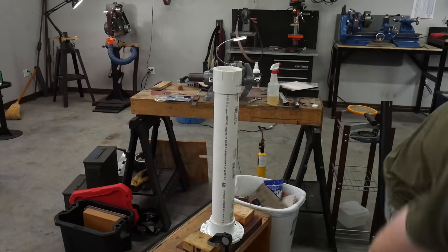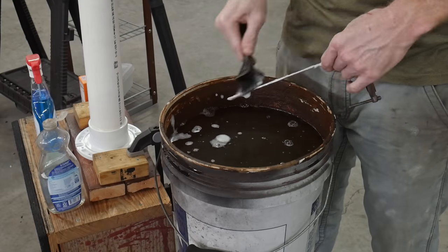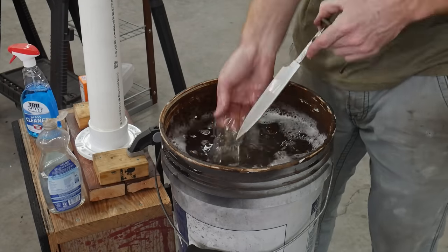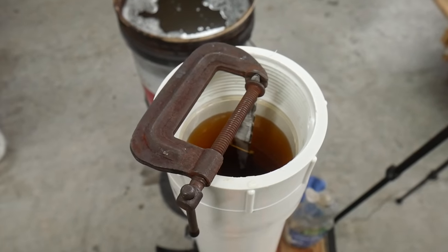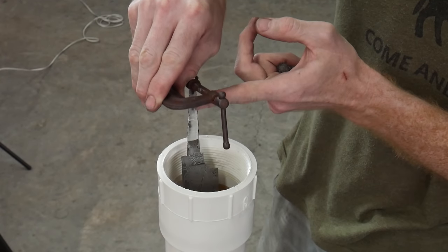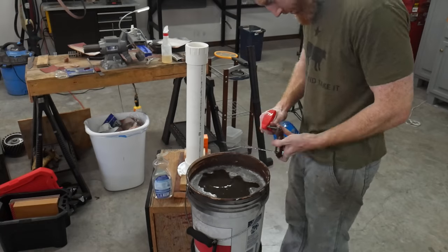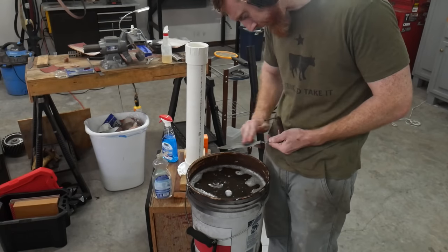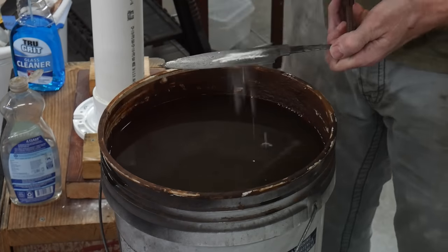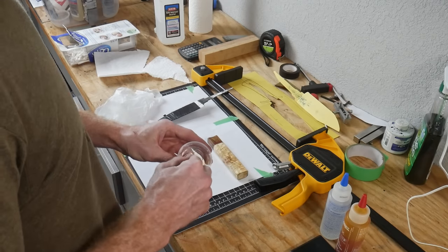I made a mix of one part ferric chloride and two parts filtered water for this tank. I was surprised at how weak the mix was — it took significantly longer to etch my blade than my previous one-to-one solution that is three years old. It could be a combination of the dilution ratio and the brand of ferric chloride. I ended up running 20-minute etching cycles. Between cycles I cleaned the blade with extra-fine steel wool, and on my last cycle I sprayed the blade with ammoniated Windex and heavily coated it with baking soda to neutralize the acid.